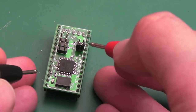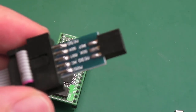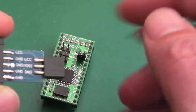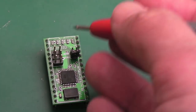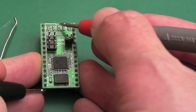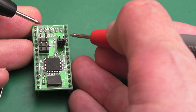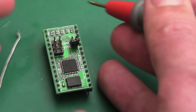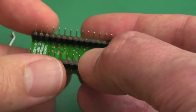Here's how I've worked out where the ground and VCC are. Looking at the adapter, on this side we've got VCC and then ground. I'm assuming it goes this way onto the adapter — so that connection is ground and that one is VCC. To confirm, testing with the black probe on the bottom right pin, with the notch being pin one on the DIP side, we've got ground there, which is correct. The fourth pin down on the right goes to the top right corner — that's where VCC is going. Now I've confirmed VCC and ground, I can assume the other communication pins are correct.